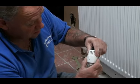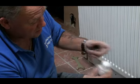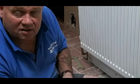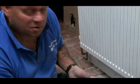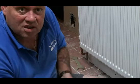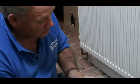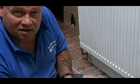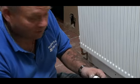So if you turn it right down to number two for example, that may turn the radiator off at that particular time. Then you take the radiator off. If it's off overnight and the room gets cold, the room will tell the thermostat that it needs a little bit of heat, the thermostat will open, the radiator valve will open and flood your kitchen. It's happened hundreds of times to hundreds of people and they've all emailed us.